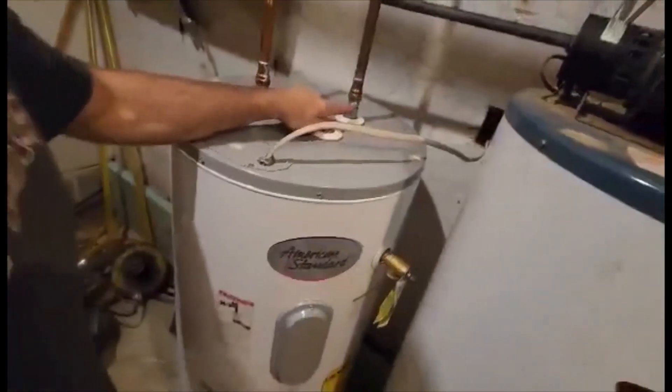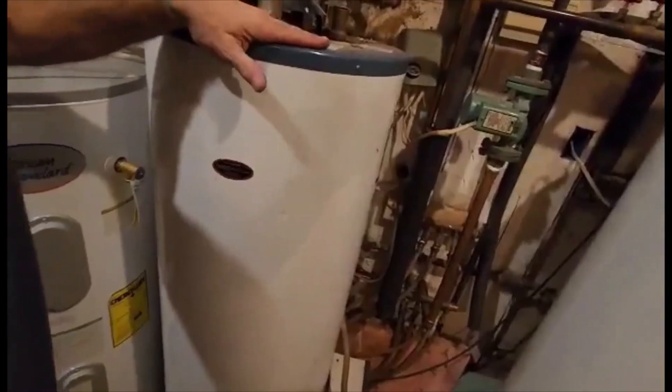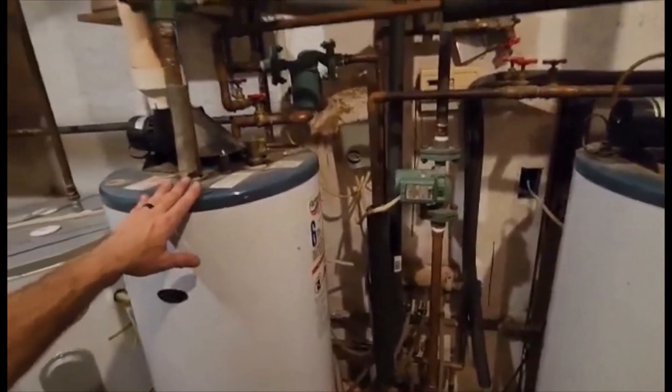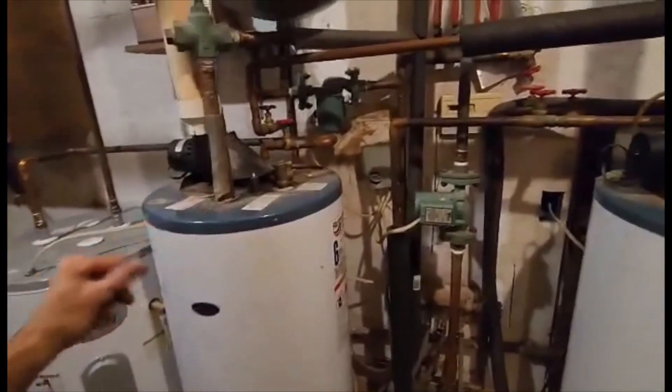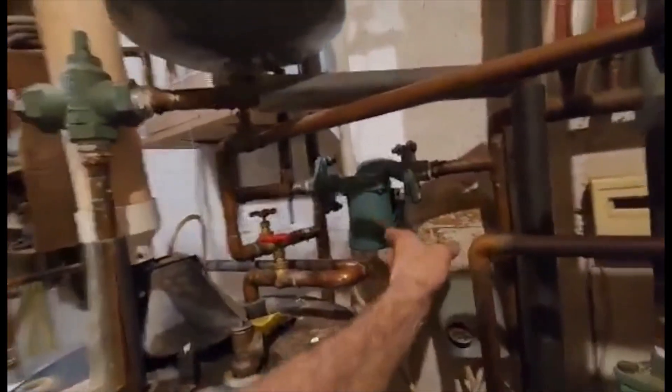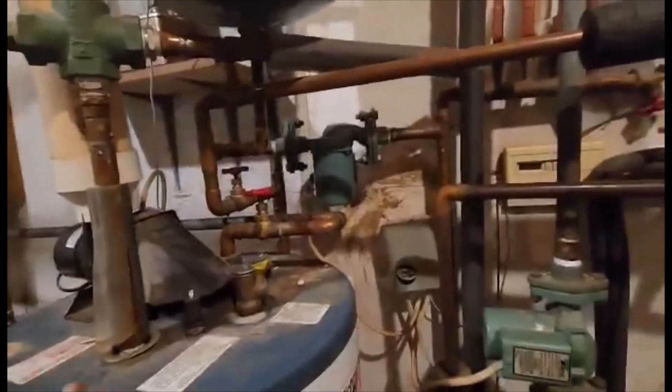We get hot water here coming out of the heat exchanger, go into the electric water heater, out of that into the propane. If the temperature doesn't reach what I need from the electric, then the propane kicks on. So the propane is kind of like the backup - or if propane prices drop, we'll fire it up more often. The water comes into this tank, out of this tank, and then through the floor up and through the floor below, coming back through these tubes. This is a new circulator pump - the other one burned out on me, was making funky noise last year and wasn't coming on. Changed that pump out, no big deal.